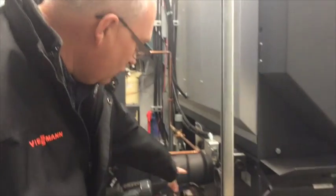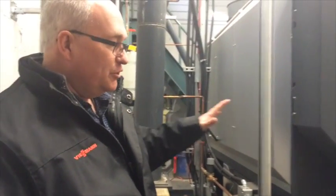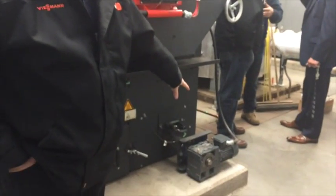The little auger down below is actually a walking bed. What it does is it pushes the pellets along and keeps them burning. And as they burn, they drop down into the ash auger when they come to the end of the line, and it feeds it up through to the bin.